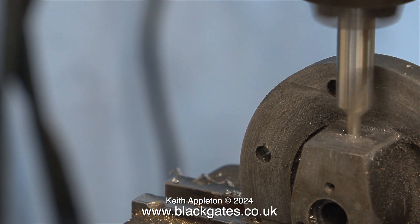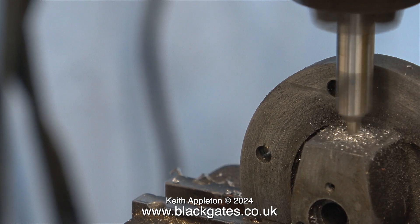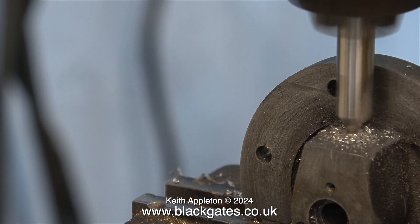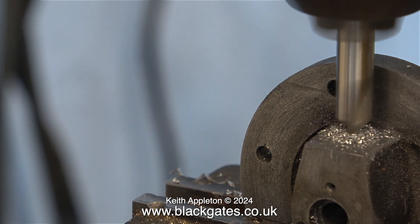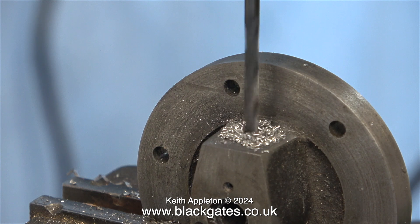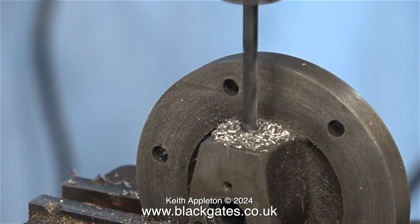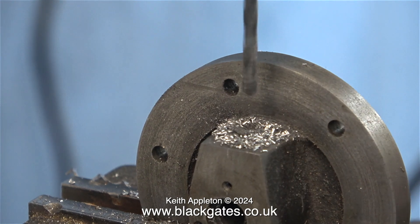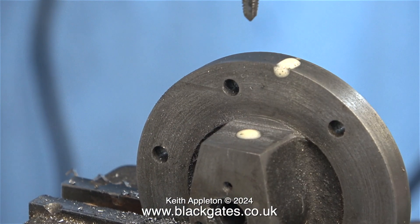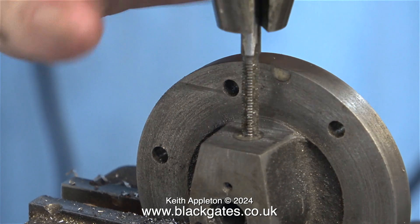I've already drilled two holes in the top of this casting, threaded them, and plugged both of them. This is a bit unorthodox, but the problem is the main shape of the casting block is not right and it fools your eye when you look at it from above. When I plugged the first hole I drilled in the wrong place, that was okay until I started to drill it again — I plugged it using a steel bolt and some Loctite 603, but the problem is the steel bolt is much harder than the cast iron, so the drill wandered to one side. The point where I drilled this hole was exactly in between the two existing plugs and it didn't wander at all.